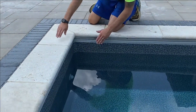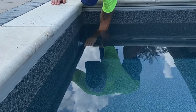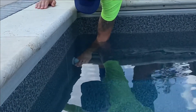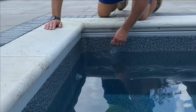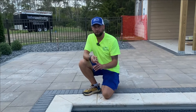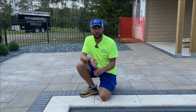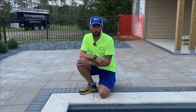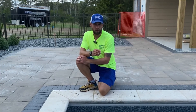What that will look like for you is if you look in this pool right here, this is the return inlet. So we ask that right where my hand is, you drop the water level just below those returns so that our team comes out to blow out the lines. If your pool has known groundwater issues or is also a floating liner pool, that does not apply to you — do not drain the water below those jets so you don't have issues with the liner.